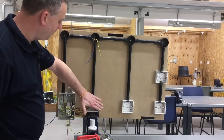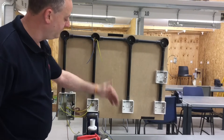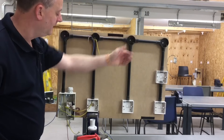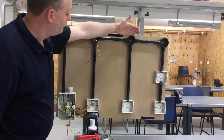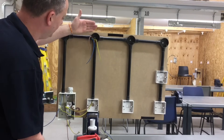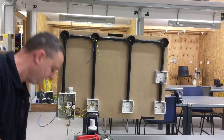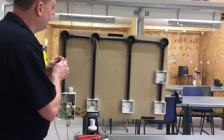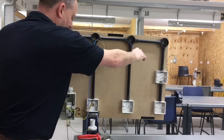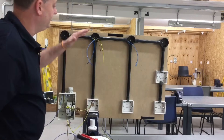We're now going to extend into the second office, so we have a one-way light switch controlling the lighting point there. First of all we must get a neutral to our lighting point. Our closest neutral is here, so we're simply going to take a neutral from here across to here. Pushing the neutral across, we now have a neutral in the second office.